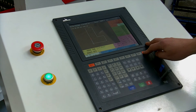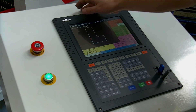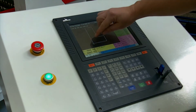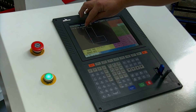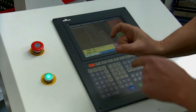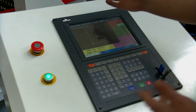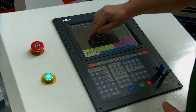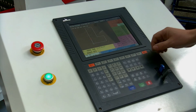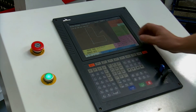There are lots of other options on here. If your machine fails for some reason — sometimes when you come to a corner, if you've got one of these plasma tables made from folded steel on the legs, when it comes to the end of a line and turns direction you get a very slight movement on the table. That's enough that the machine won't recognize the hole, the plasma cutter will lose the arc, it fails, and it stops. That's why all the tables we use are really solid. But on this program itself you can also return a little bit down the line and it will start the cut again, so it can compensate for poor tables. So it's a really useful piece of kit.